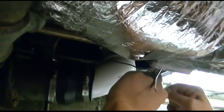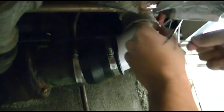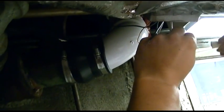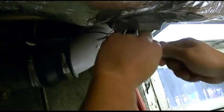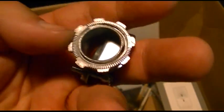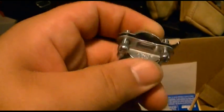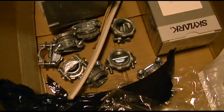We're in this box now, we ran the wire in using some clamps. All you do is match the colors up: white to white, black to black, and bare to green because green is ground. We're doing the white wire there — just twist them and throw the wire nut on there. Fold it up in the box and put the cover on. The clamps we're using are standard metal box clamps — Romex connectors. They have a little ring that unscrews, then it screws onto the box. Put the nut on the inside, tighten it down, the Romex goes through and clamps up. Tighten the screws and that's it.